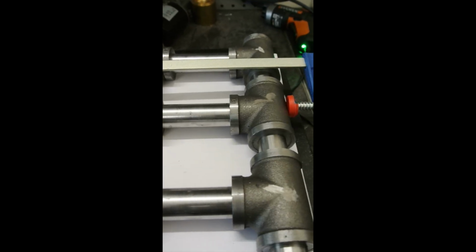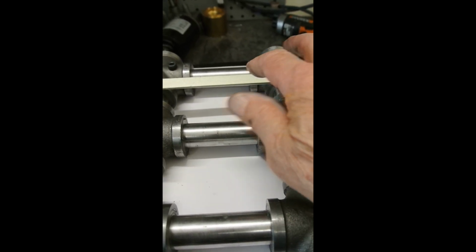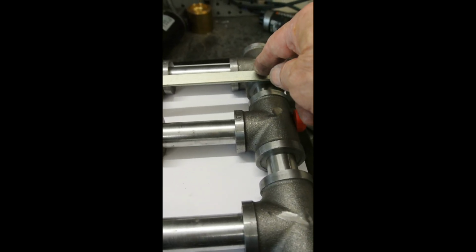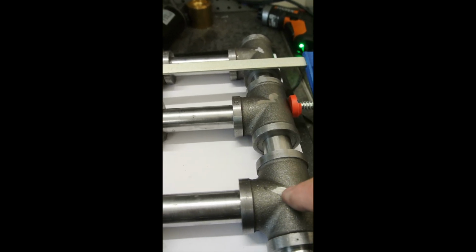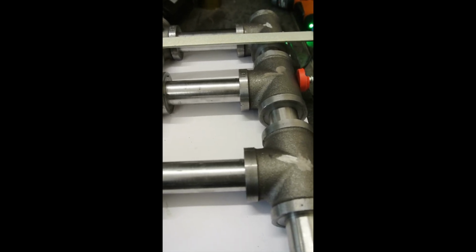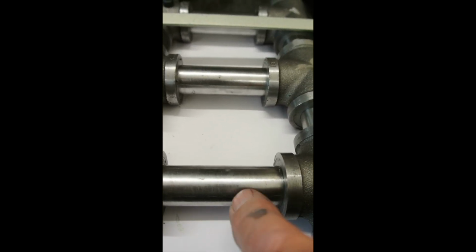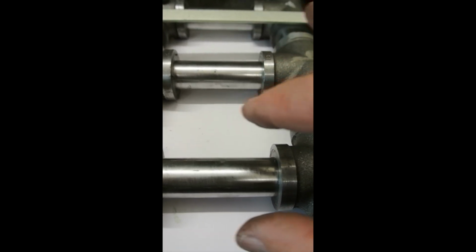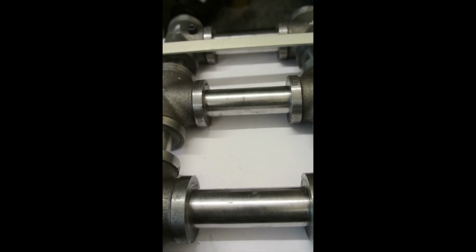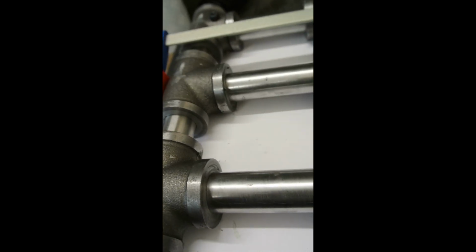So I know when I come to do this side and disassemble these, I just assemble this part here with epoxy on it, and then the back part of this, the lower part inside the case, inside the casting, with epoxy in, squeeze it together, and then as soon as the face of the sleeve in here is tight up against the casting, I'll know that that's gone fully home. Then I can measure everything and just check it. I can clean it up as well, because the epoxy takes a little while to set. I can clean it up, as you can see here.